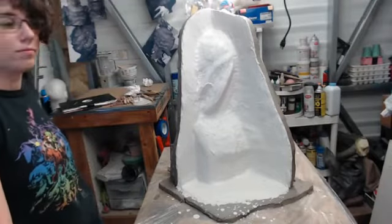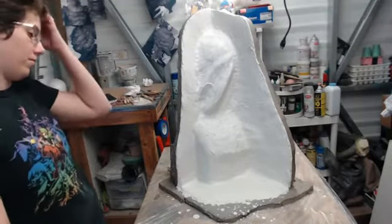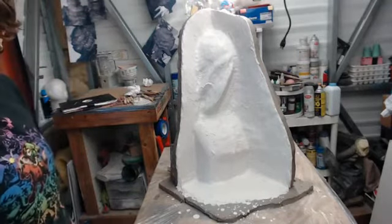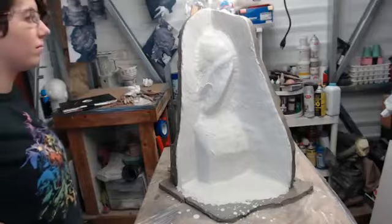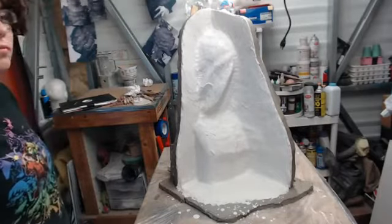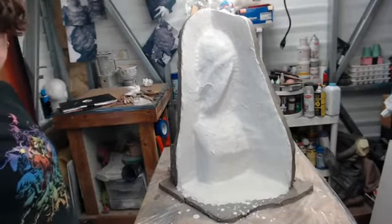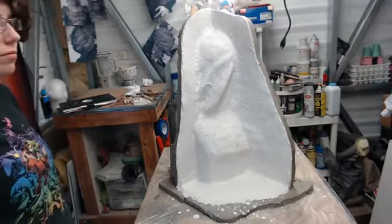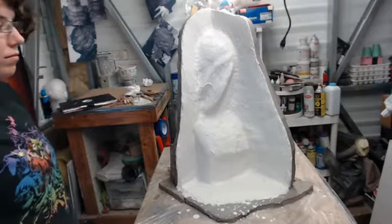I've had that happen in print coats early on because I waited too long between layers and literally the first print coat delaminates from the second print coat. So you're basically looking into no detail. And that's really common as well with casting plaster molds because they don't like to stick together no matter what.